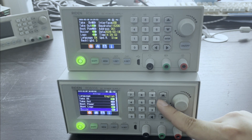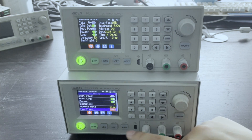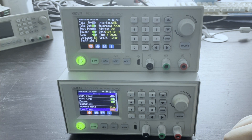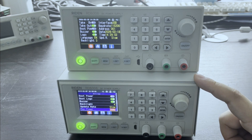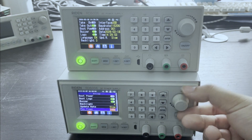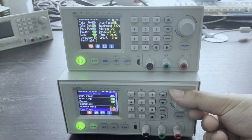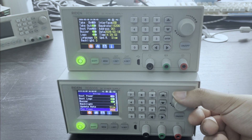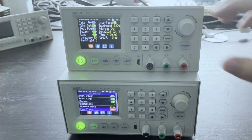You can see here the output power can be set by yourself. For some loads, it cannot withstand higher power. If the power is over what it can withstand, the load may be damaged. So you need to set a max power on the device. For example, I set 380, then I can adjust it to 300 watts so that the output will not exceed this value to protect the load. On this old model, it doesn't have this function.